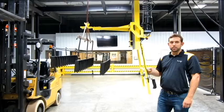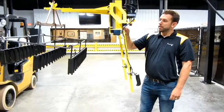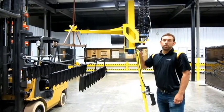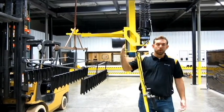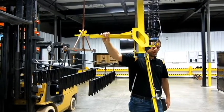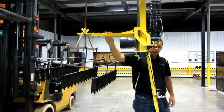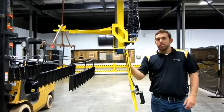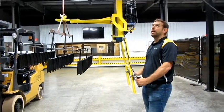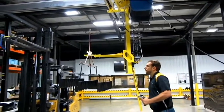And that's with over 100 pounds of force on there. All that this is doing is sensing the force that I'm inputting. This is different than if you were using other G-Forces in float mode, which some people may be familiar with, where you can actually grab the part and go up and down. You can't do that with a remote sensing hub — that's a safety feature. You have to be engaged underneath the remote sensing hub. So back engaged, brake disengaged, light is on, and we're active again.